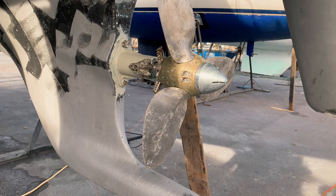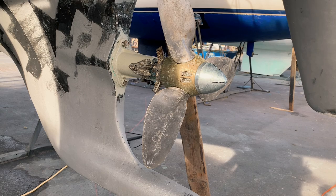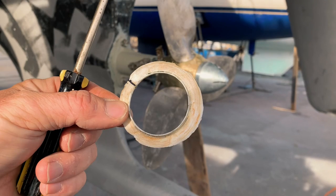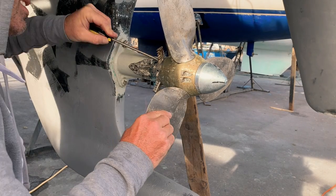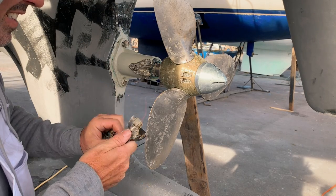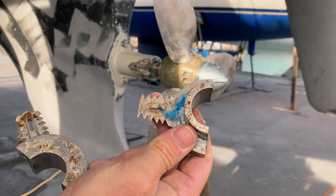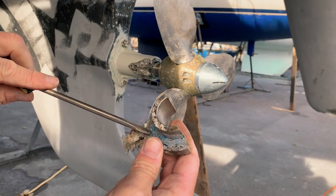With the blades of the rope cutter removed, we can now apply the two new discs. We also need to spend some time getting residual strands of polyprop rope from around the cutter. That's the old disc — completely worn out. The abrasion from those two opposing rope-cutting plates causes them to wear out, and they wear out far faster where there's silt in the water. For those keeping boats on mud moorings, be aware that the maintenance schedule is different. Quick clean with a screwdriver, making sure not to scratch the surfaces.